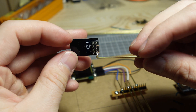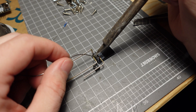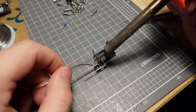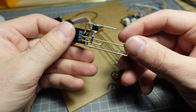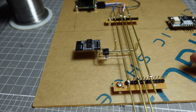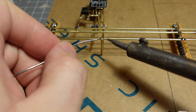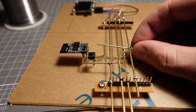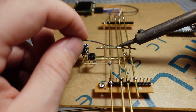The brain of this project is a little ESP8266 on an ESP-01 breakout board. Previously I've used these as a Wi-Fi module for a larger Arduino project, but here I'm using it as the entire microcontroller as well as the Wi-Fi connection. This simplifies the circuit greatly, though it does mean I'm limited to only two GPIO pins — you can make that four if you're willing to sacrifice serial data for debugging. For this project that's more than enough, as the I2C screen only requires those two pins anyway. As much as I wanted extra pins, I resisted the urge and kept it really simple, since there are always expansions I can do in the future.